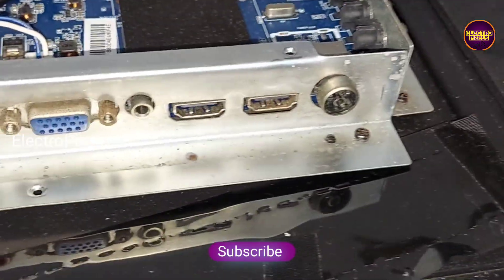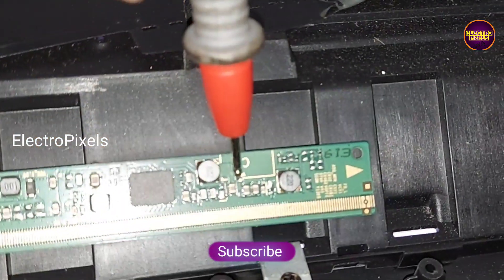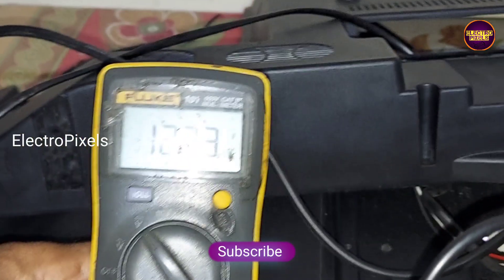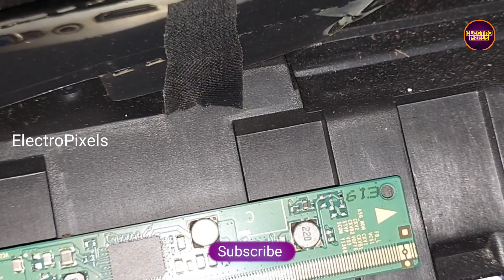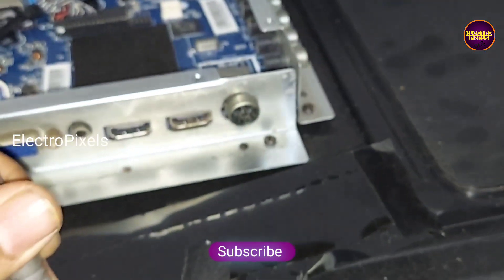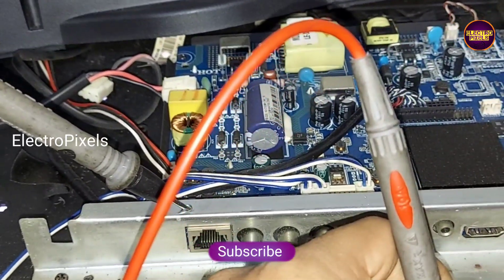First we need to confirm the panel shorting on which side. If the panel is shorting on the right side, then we need to block the gate signals entering the panel from the right side — for that we need to cut down the right side gate signal tracks. If the problem is with the left side, then we need to cut down the left side gate signal tracks. You can see that instead of the input VCC 12V, 3.3V, 1.8V, all other basic panel voltages like VGH, VGL, AVDD are missing from this scalar board. It's because, as discussed earlier, due to internal shorting in gate signals the DC-to-DC IC named SM4186 goes into protection mode.